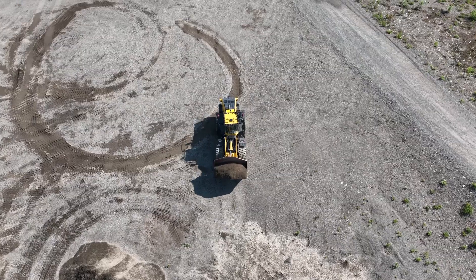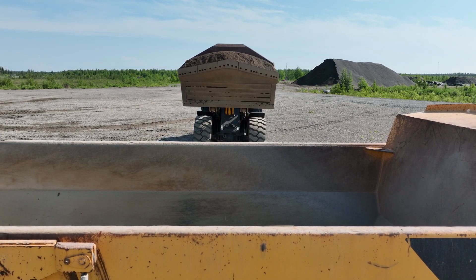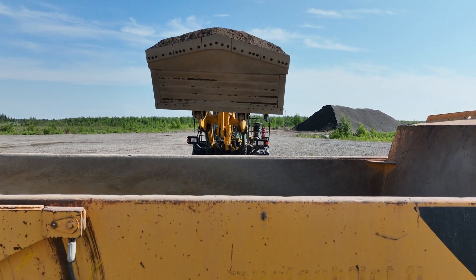It will take over and drive the machine to the end of that point. They do this by creating waypoints, which tells the machine a straight line to go to or where it should be driving. So essentially when I click auto, when I'm in that geo-fenced area, it knows it's at the beginning of the cycle. It'll drive on its own during that waypoint path and go to the very end waypoint that's set — let's say where the truck should be to get loaded. This gives me a chance to run another machine, whether it's on site, a different site, different country, whatever. If I'm busy on the other machine for a couple seconds, this machine will stop at that last point and wait till I click over and take control of this machine. It's just a game changer using one operator to control multiple machines.